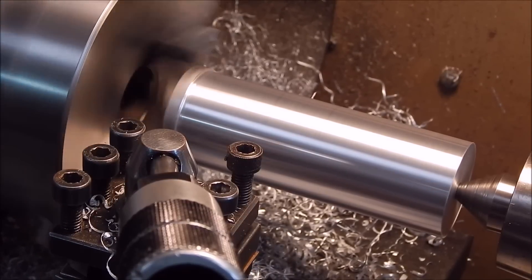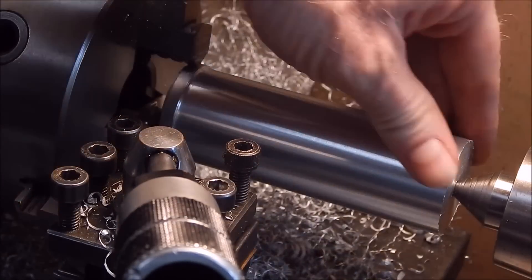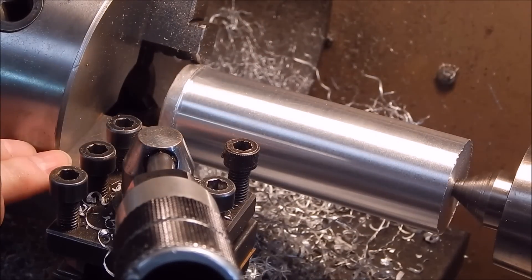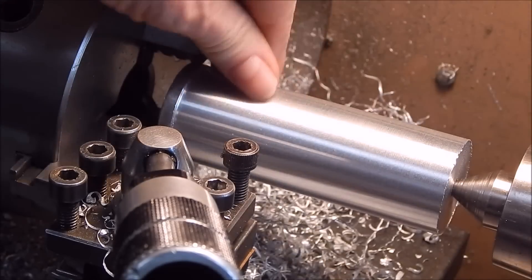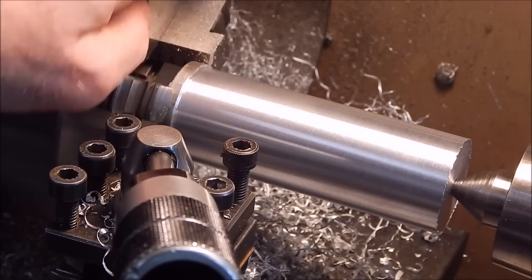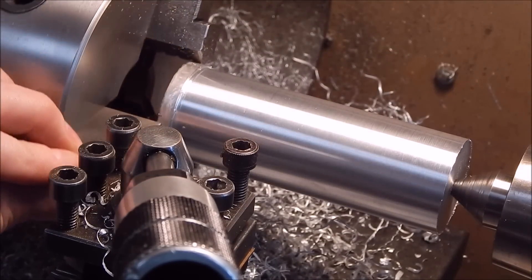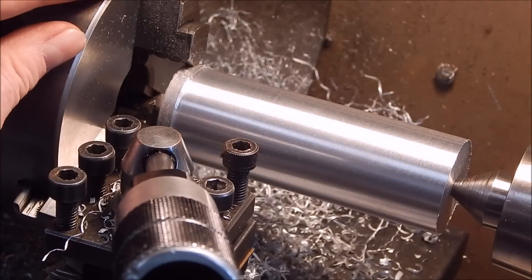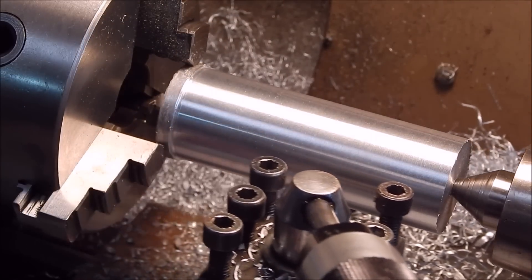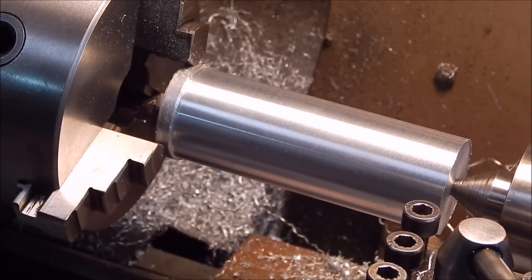Here's our finished job — pretty nice, and it didn't cost me a bean. Go to a shop and see what they'd charge you for that piece of aluminium. You pour your own aluminium, melt it, pour it in a bit of pipe, machine it back — as you can see it's pretty good. There's a tiny little bit of porosity in there but overall that's a nice bit of alloy, certainly good enough for use. You can see how well the shear tool worked — it's a good cutter to experiment with. Hope you found the video interesting and got something out of it. See you next time, cheers.